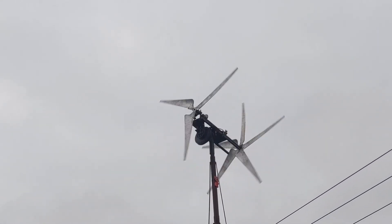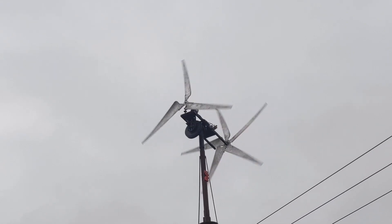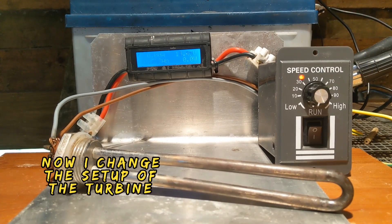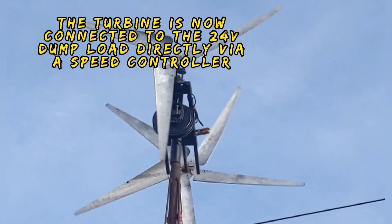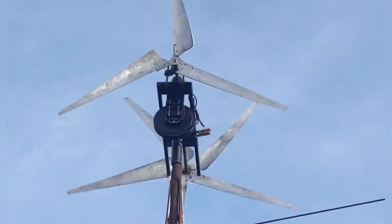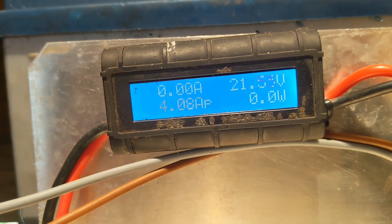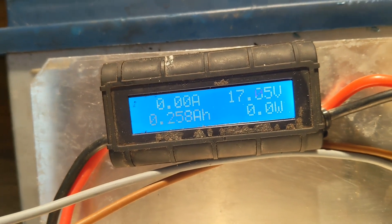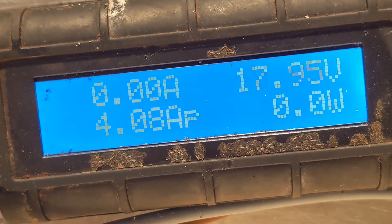What I've done now, I've disconnected it from the 12 volt battery so it's allowed to run faster. I'll show you what I've done inside. I'm setting this up now and we're going to see what this does. The turbine's in small gear on the drive shaft so it can run easier. That's the maximum voltage it's going to be producing unloaded — whereas if it had the other gear set up it would be running about 35 to 40 right now.